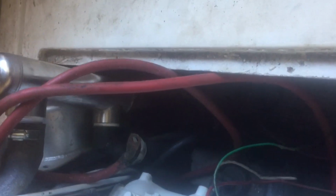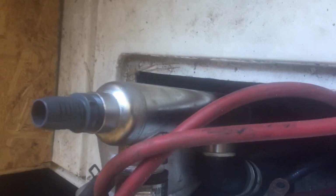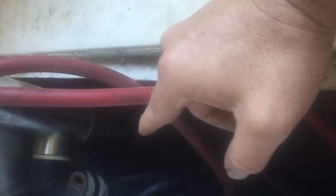And then it'll go from there to here as 1.5, 1.5. And that's a 1.25 inlet with a 1-inch hose barb. And we need to up that to a 1.5 inch hose barb. Yeah, on the bottom one. This one will have to be a 1.25 inch hose barb, but we're going to do a U-turn, bring it down, and our transmission cooler will be over here, mounted up on this wall. And then it'll turn and go down and into our exhaust.